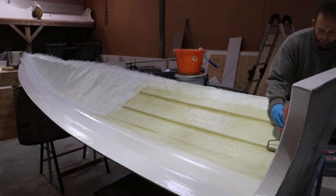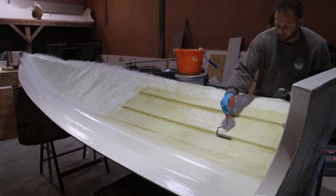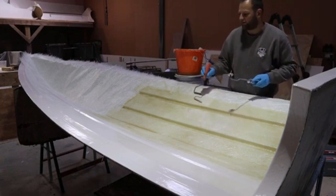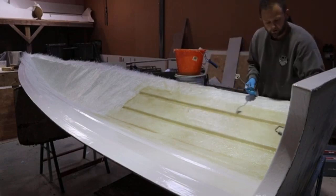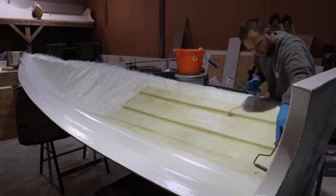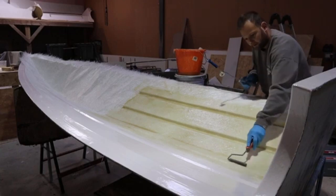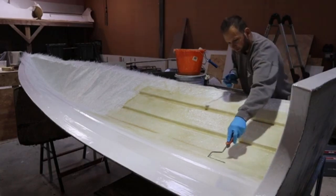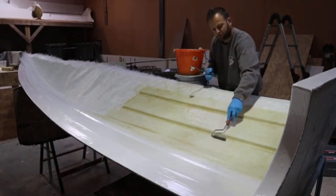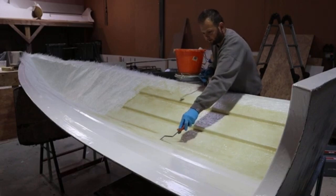So what you may find is if it's below 15 degrees, the resin may take longer to go off and you really need to catalyse that 2%. If it's higher, or you're multi-layering, or there's a chance that things are going to get very hot, then the suggestion is to lower the amount of catalyst you're putting in it. But you have to do this with great care, because under catalyzing will cause issues, because the resin may not have been mixed correctly. It may not be warm enough for that mix to go off fast enough. And we talked about the sort of 2-day window maximum to get things to cure should something happen. Okay. There's all things to take into consideration.